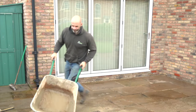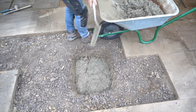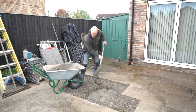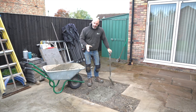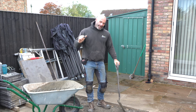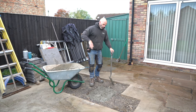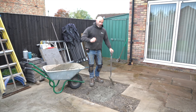We need a bit more concrete. Now the hole is full of concrete we can put our flags back down. The concrete is a 5-to-1 mix; we're going to put the flags on a 4-to-1 mix. We're going to put the flags straight on top of this concrete before it has gone off so that as everything goes off it all goes off in one solid lump. That's important — it's all behaving as one pile of concrete, sand, cement and flags so that it can't sink at all.